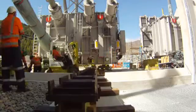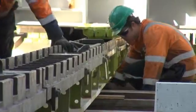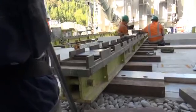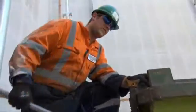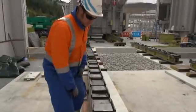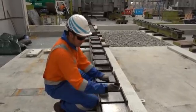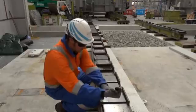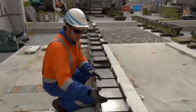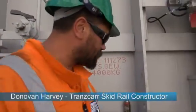The actual sliding only takes about two hours, but the prep work to do it takes about five. These are the tracks that we're going to slide the transformers in on — they take the weight of the transformer and slide over oiled blocks. A pneumatic piston is locked in here and pushes the transformer in, then they move the piston to the next track, and piece by piece the transformer slowly slides across the tracks into its final place. Our skid rails are perfect, ready to skid in.